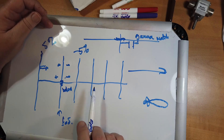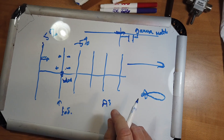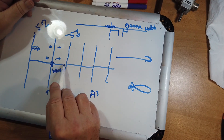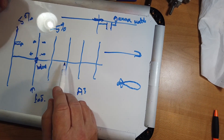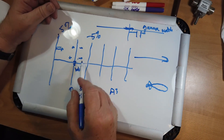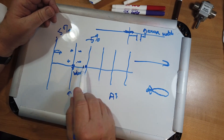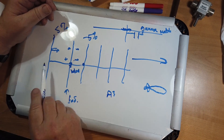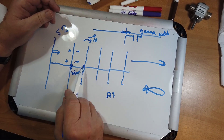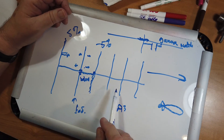The newer antennas reflect this. You can still buy the old antennas like the A3 from either Cushcraft or Higain — they have three elements. You can get them with four elements. Getting an HF beam with more than four elements is hard; they get wobbly. Your mast, which comes out of the top of the tower, is going to hit it in the middle of its center of gravity. The cable will come up here, along the boom, and connect at the driven element.